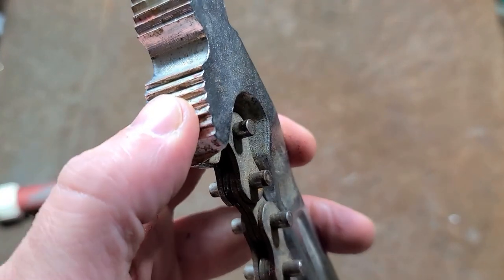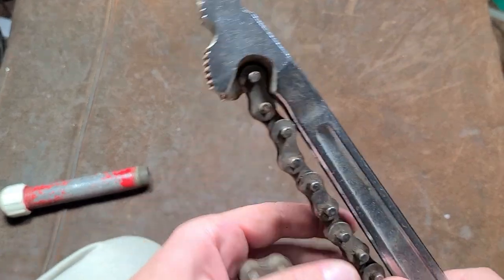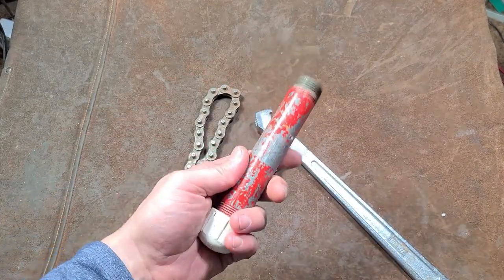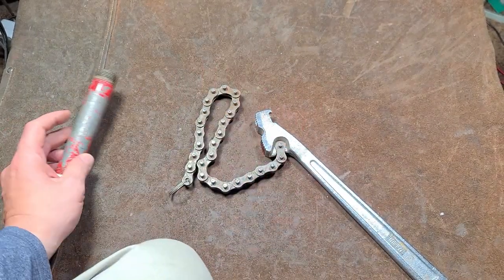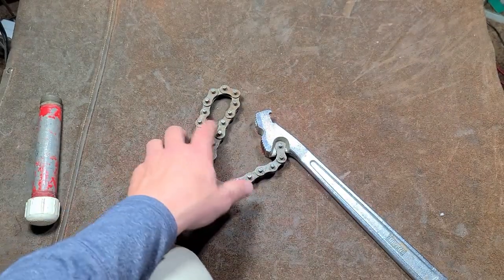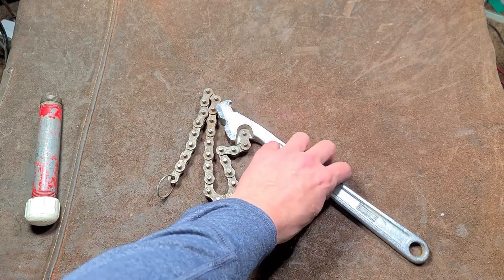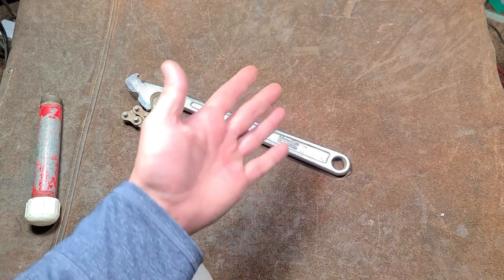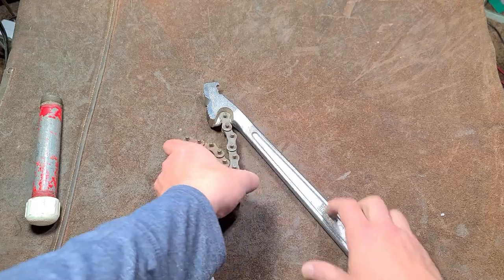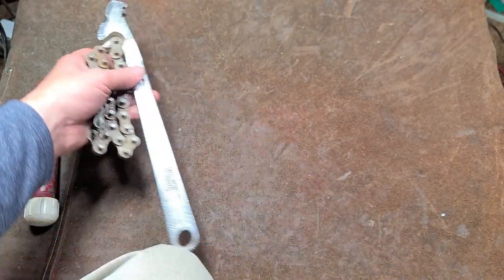Part of the issue is that the jaws just aren't quite sharp enough on these, which I always find odd. That's why I haven't liked this design — most types of pipe wrenches really do work on small and large pipes equally well, with teeth that really bite in. This Empire flat jaw style is also sold by Williams, Snap-on, and quite a few other companies, some with 24-inch handles, but they all end up having the same issue with not getting much grip on smaller diameters.